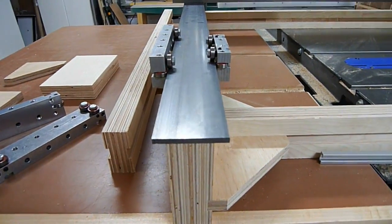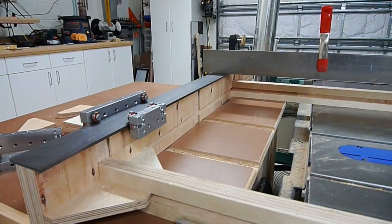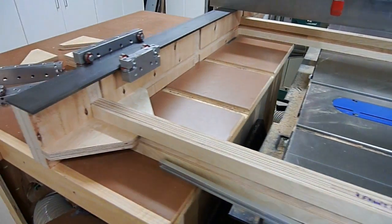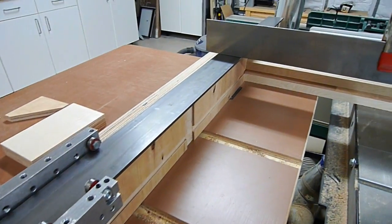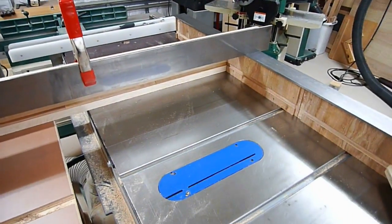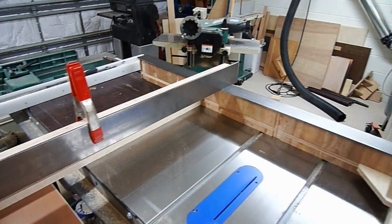On this first rail here I've glued up three pieces and then run in all my notching, which allows this panel to go together pretty easily. These are the cross braces here and I've got 45 degrees which go into each side to lock it in place. I don't have the other braces in right now because I'm just showing you a general overview of how it's assembled.